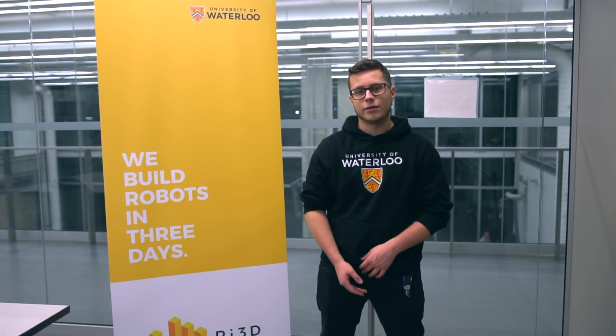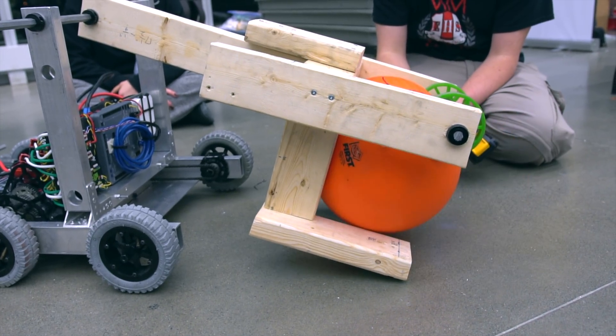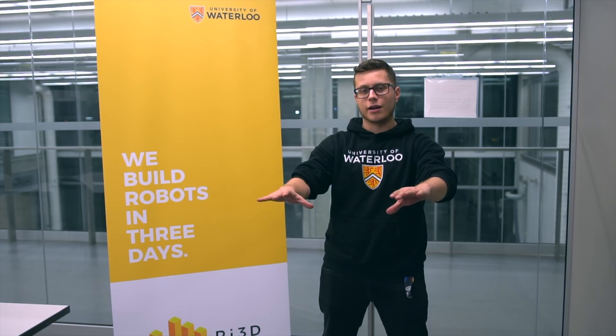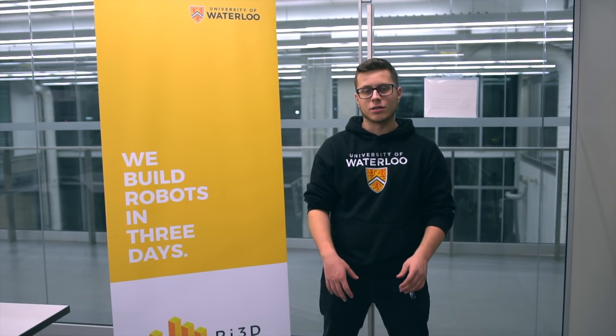For the cargo mechanism, the sub-team CAD'd and designed a fully functional prototype featuring a claw mechanism that comes down from the robot to intake the ball. This was very different from the first iterations made yesterday, where we were debating between passive loading from gravity or just one roller. Today we decided to use a roller that comes over the top and claws the ball together, and we're able to lift up that claw and deposit it into the cargo ship and onto the low-level rocket. Hopefully tomorrow we'll fabricate it out of aluminum and get it working on the robot.